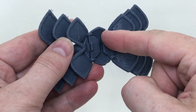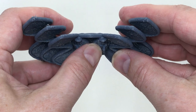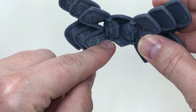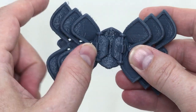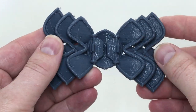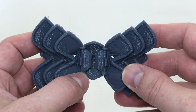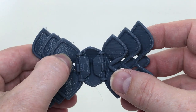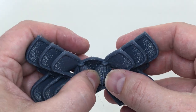Now these two pieces here are designed to be hinged. Right now they're static parts — they don't move — because there's a socket down here and then the pin of the hinge, and they're designed just the right distance apart so that once they break free they'll hinge and pivot fine. Prior to that, the 3D printer can build them without any trouble and without generating any support material, and I don't want to assemble parts after the fact.